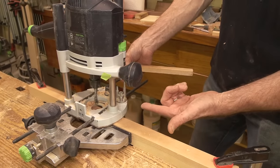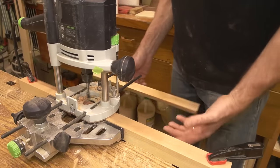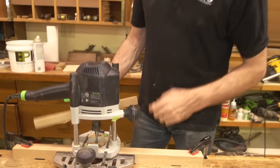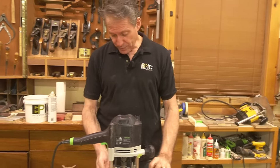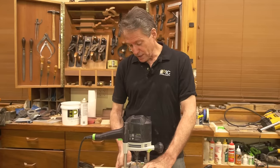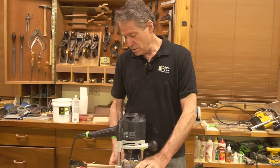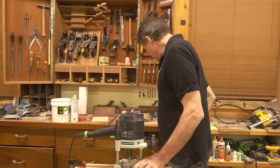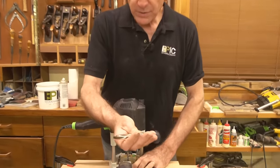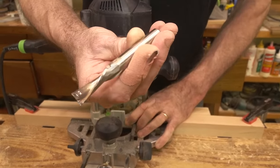Once you've got your adjustment to the distance — how far off the face of the work piece you want your mortise — I went with three quarters. I'm actually plunging with a three-eighths router bit. This is one of the new spiral router bits I got from Woodpeckers. They're actually making their own bits now. If you saw the video we made when we took their factory tour, it was unbelievable. They're beautiful bits. This one I got with the multi router — I burned it a little bit, but they're just gorgeous bits.